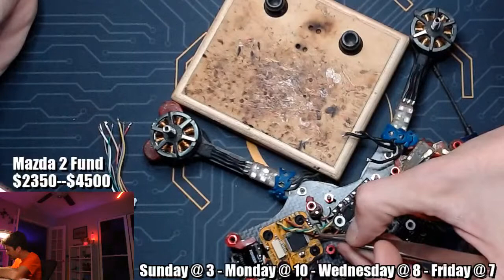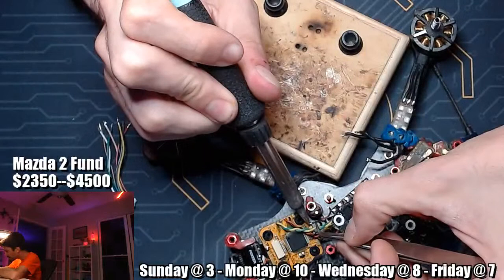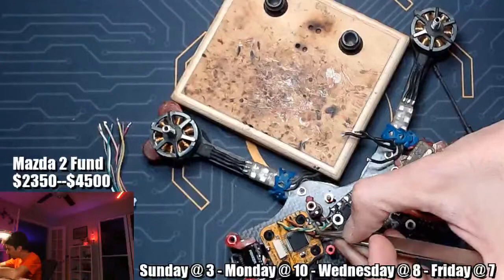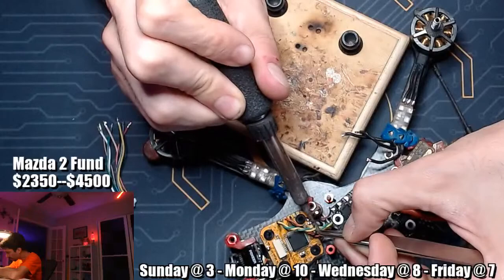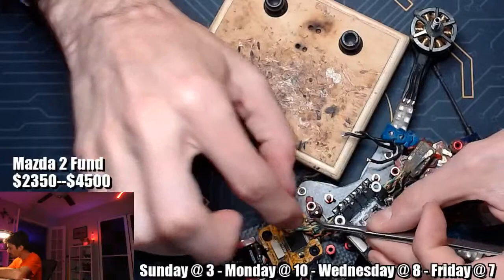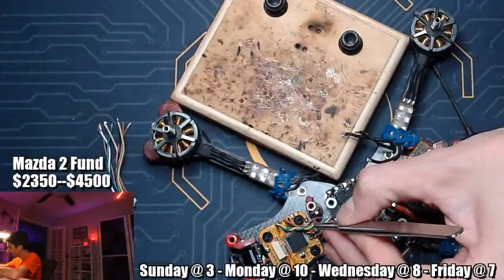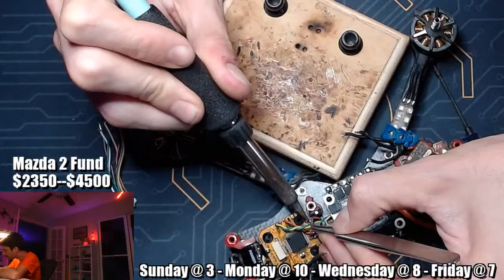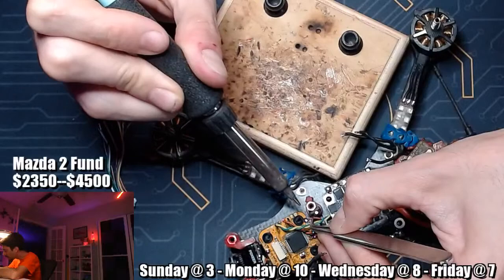Tin the tip of the soldering iron. Bring the heat in. Oops. I've got too much solder on the tip of the iron. Let me get some of it off of there. That's better. All right, we've got that. And then we're going to do the 5-volt here next. Okay. Same deal. Tin the tip of the soldering iron. Get it on the pad where you want it. And just touch it with heat. And there we go. Our microphone has power.